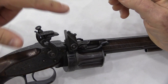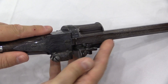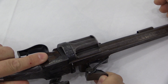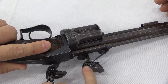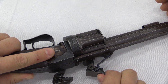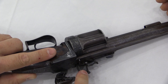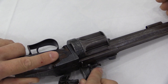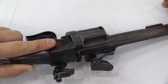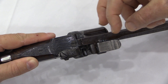So this is ready to fire. When you fire, the frizzen is going to get pushed forward, and you can see that linkage operating the tumbler there to reset and drop powder. When it comes completely down, that's when it actually releases powder. Then when it comes up, it refills that valve with powder ready to deposit another priming charge, and closes off the reservoir.